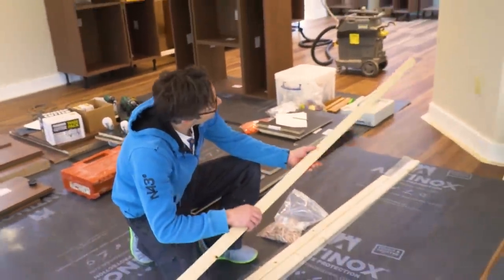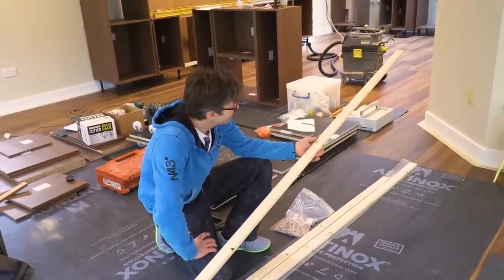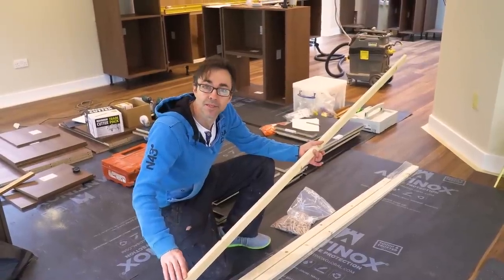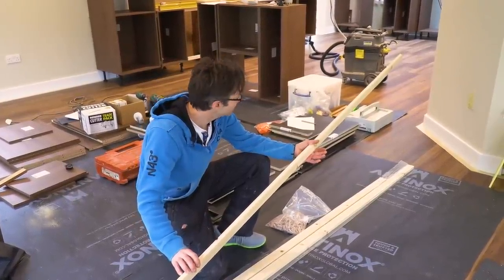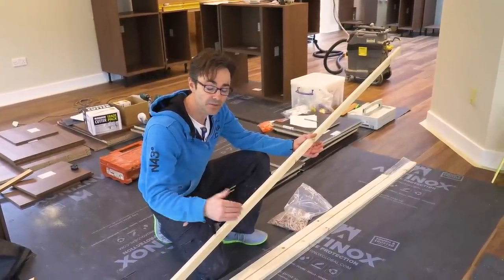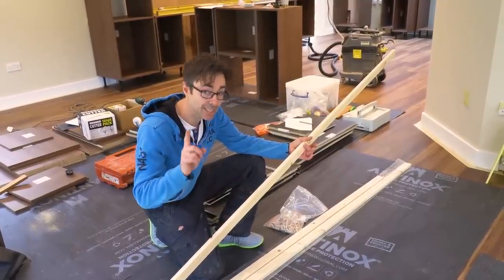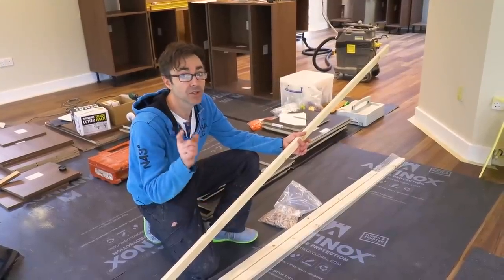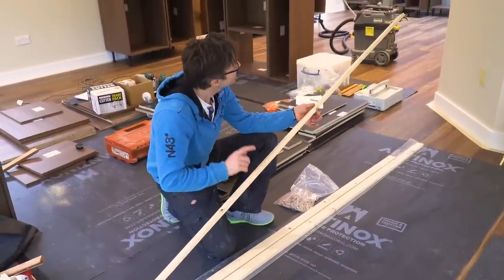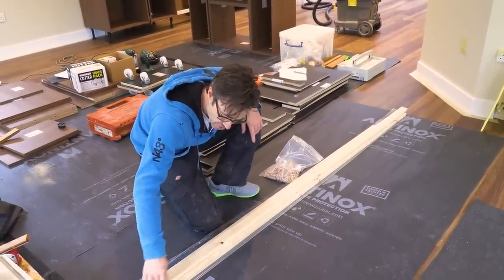I like to buy some economy timber — what I call two-by-one, so 50 by 20 — and it's really good material for setting out. I also use it as a datum at the back of my carcasses. My carcasses have a service void behind them, which is pretty important to make sure you can get your waste pipes and water pipes through, and allow enough space for appliances like a dishwasher. I set this out first and mark all my unit positions on it, like a rod.